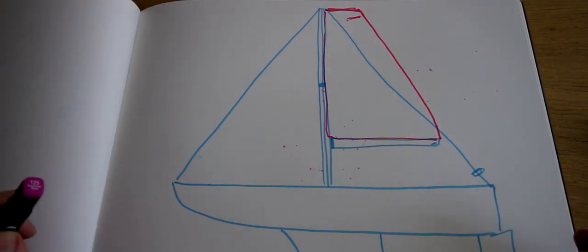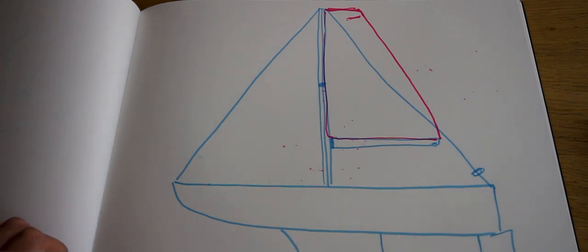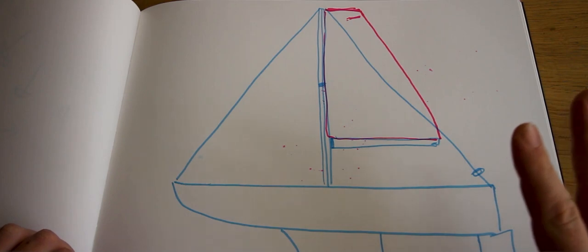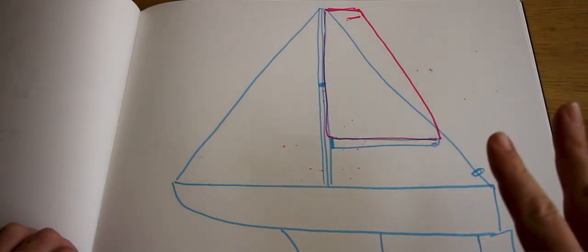That's where a very important role of the sails comes in, which is a process we call reefing. The word 'to reef' or 'reefing' is a sailing term that means to make sails smaller — to reduce the amount of sails. So if I say 'let's reef,' I mean we're going to reduce the number of square meters of sail we have up. 'Let's take out a reef' means we're going to take away the reduction we made previously. We're going to go through all of the reefing options on my boat to explain the general principle.